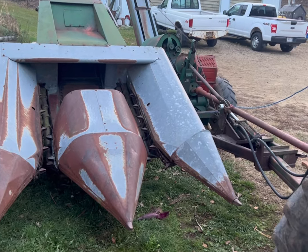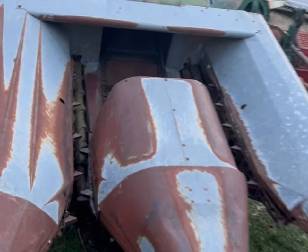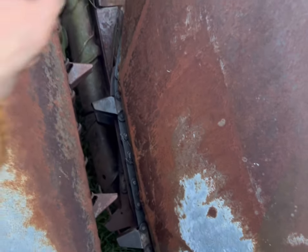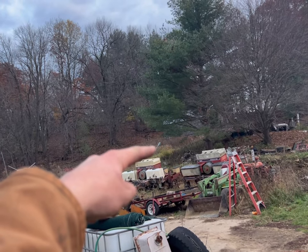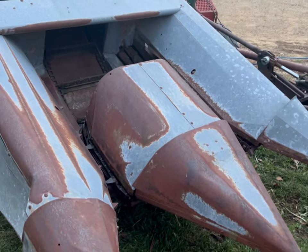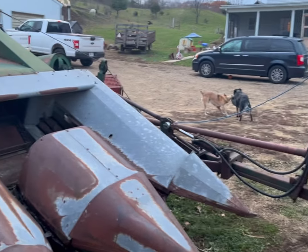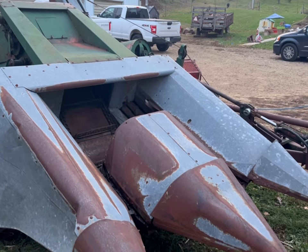I finally have this thing all back together. I kind of missed the last part because I forgot to film it, but I got these two chains — really easy. Just pull those two pins, pop the top link off, slip out the other piece, and just unwrap it and move it from the old picker, which is now up there in the weeds — you can see the top of the elevator way over there. So now all I have left is to oil up the chains on this thing. I already greased everything; the grease fittings are kind of weird because only some bearings will have one and then others don't. So I'm just going to oil up the chains and then that's it — hopefully the next video of this is when we're picking.